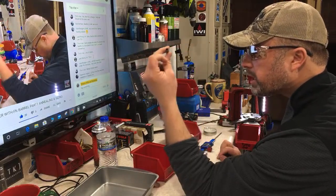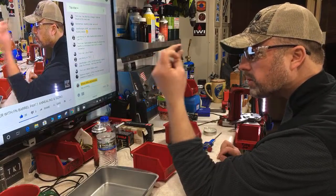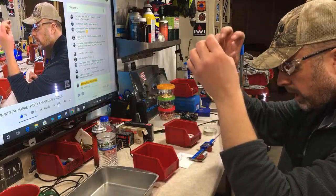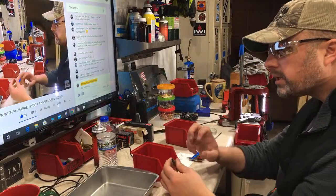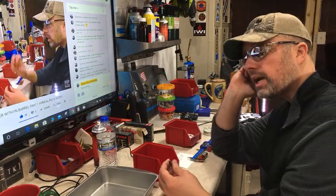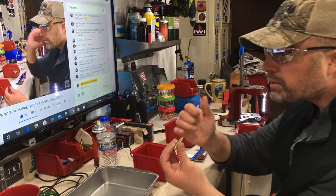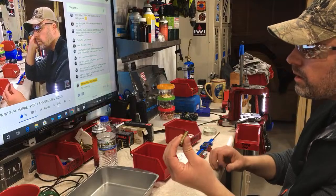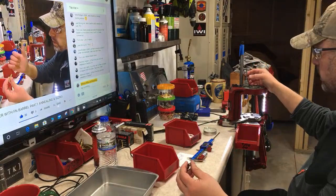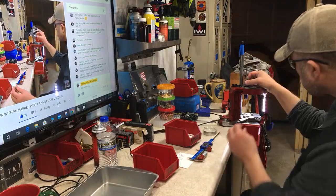And the only way I'm going to get that freaking thing out is I'm going to have to mortar that charging handle. I'm literally going to have to grab the charging handle, slam that buttstock down while I'm pulling on the charging handle down on the bench, and yank that freaking case out of my rifle's chamber and hope to God it comes out. And sometimes it doesn't. Sometimes it rips the lip right off the base, and it's not good. So anyways, we need to continue going till we reach that 1.453. So we're going to screw this down a little bit.